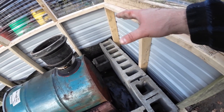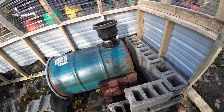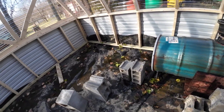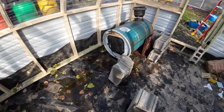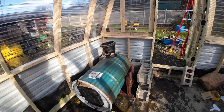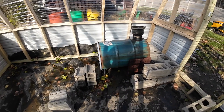I'm starting to build a small little holder wall to do two things: one, it's going to retain heat better, and two, it's going to act as a firewall. We have enough double-wall pipe to go straight up and out the roof — we got that from our house, we had an old wood stove so we're reusing that.